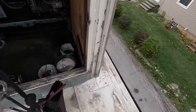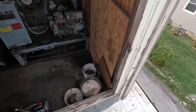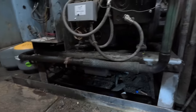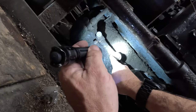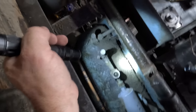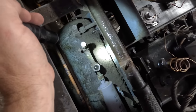Since you're going from a different kind of oil, it'll probably break stuff loose because these systems are old and nasty. And with it being already low to begin with, my worry was it would go down over the week. So we brought a different sight glass — they went with a big monster three-quarter inch, dropped it down to five-eighths. We're going to pump this down; we recovered out of the receiver, that'll speed it up some.